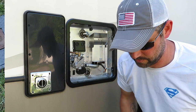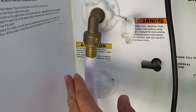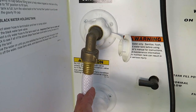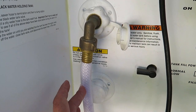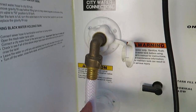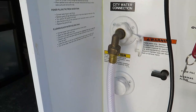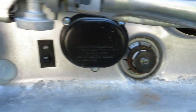She's on — let's turn the water on and see if she's going to leak. When you turn city water back on you can hear water running through to fill the hot water tank. Once you stop hearing flow at the city water connection, your hot water tank is full and everything is pressurized. Come over and check — it's all still dry, which means there are no leaks. Now turn the hot water heater back on from the outside, then from the inside, and put the cover back on.